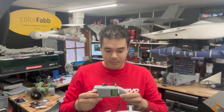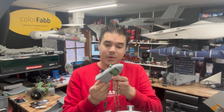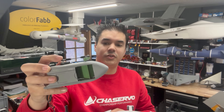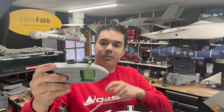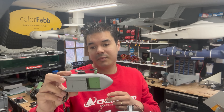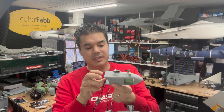We've come to a point where we're going to add a skill feature called a puffer duct - correct me in the comments if I'm wrong. This is an actuator that moves a valve for roll and yaw momentum. We use a small EDF to blow air to the valve, which guides the direction during yaw momentum. This is quite new and I don't know if it works, but we're going to find out. Let's build this into the fuselage.